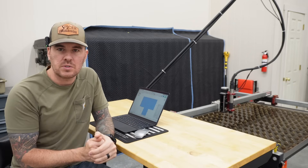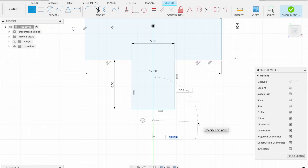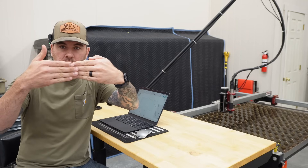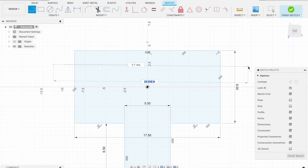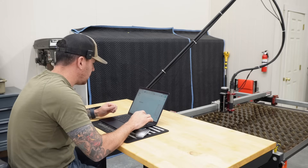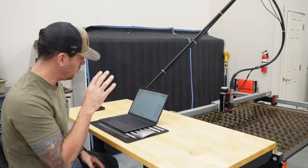So we can add some holes, and I'll use the trim tool — have to double-tap because there are two overlapping lines. Now we have our nice open T. The first thing we're going to do is throw some holes in it, then add the decorative features afterwards. The holes are important as far as placement. I'm going to put my reference line back in here so I can use the symmetry tool again. Picture a seam right down the middle where the two headers join, sitting on top of the column underneath — the column is going to be notched to accept those two headers. We'll add a couple more reference lines and use the dimension tool. We're going to make these two inches off the top and two inches off the bottom, leaving five inches in between.